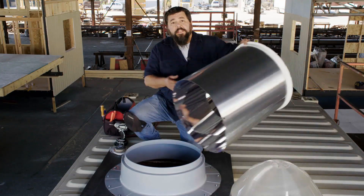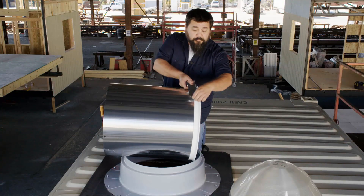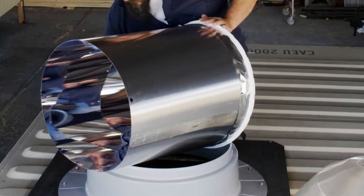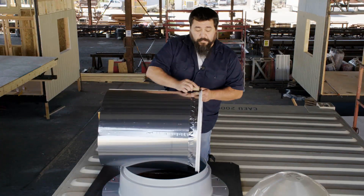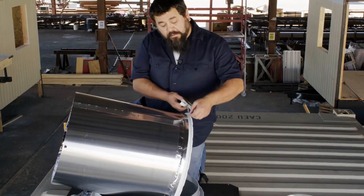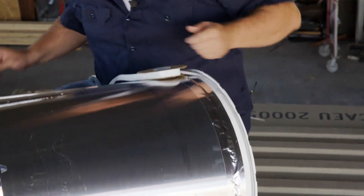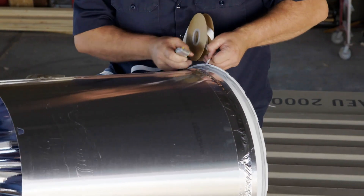Now that all the fasteners are set, we can finish assembling the tube so we can install it. To finish assembling the tube, we need to take our foil tape and attach the tube ring to the tube. We'll apply it halfway on each side, and once we've reached the other side, we can just tear the tape. Because it has a pressure-sensitive adhesive, we want to use something to seam it down. Now that the tube ring is fastened to the tube, we can add the butyl rope seal. The butyl rope seal is installed right on the underside of the tube ring to provide a water barrier between the flashing and the tube ring. If there's excess butyl tape, just take a knife and cut the remainder right on the edge.